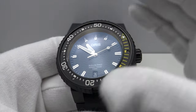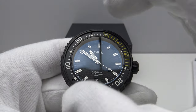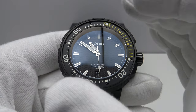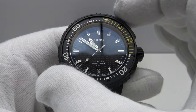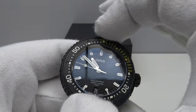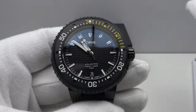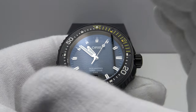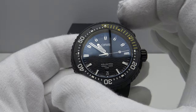I question whether the RSS ring is really necessary. Early dive pieces used friction bezels; an improvement was the uni-directional ratcheting mechanism of 60 or 120 clicks. But at 1,000 meters, significant atmospheric pressure is exerted on the bezel, compressing it tightly to the case — so there's no real risk of a uni-directional bezel being knocked out of position. A 120-click titanium bezel with teeth all the way around would have worked just as well. The RSS ring is innovative but not aesthetically pleasing.